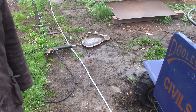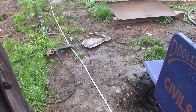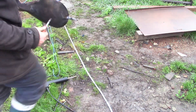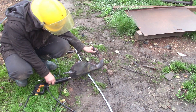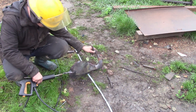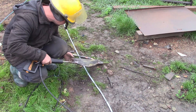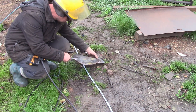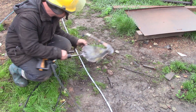Okay, not working quite as well as I'd hoped but we're getting a lot of water leaks so let's weld them up and see how we get on. She's welded up again and I gave it an even better annealing this time. Hopefully the welds are softer as well now. I'm not surprised they're splitting because we're flexing them from behind, really.